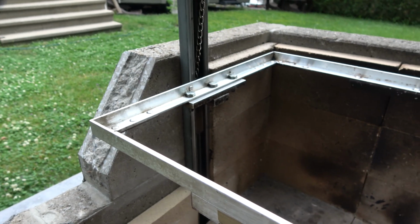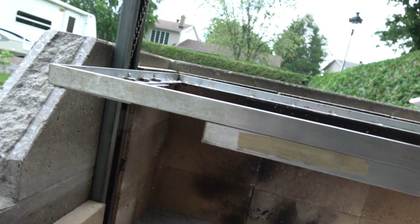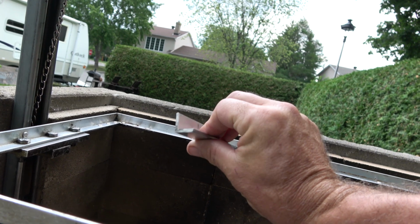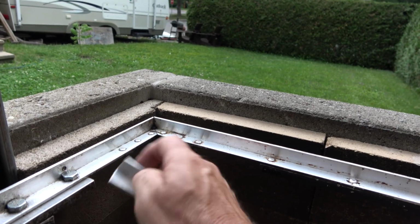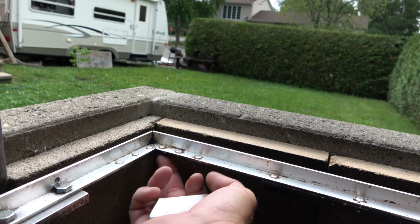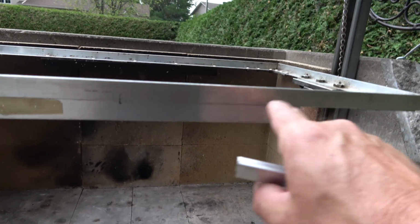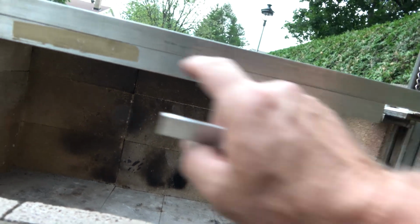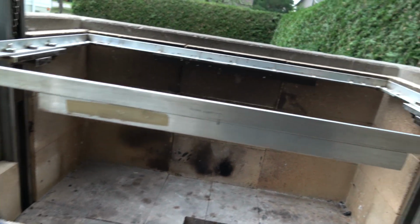As for the contour for the grill, it's aluminum, and it's about 3/4 by 3/4. It's a corner, and you just cut them to length. And I have used heavy-duty rivets with a steel plate, steel corner right under. So I did my 4 corners like that, and I have doubled these parts here for more strength, so it won't bend. But I've been using it for 1 year and nothing has bent.